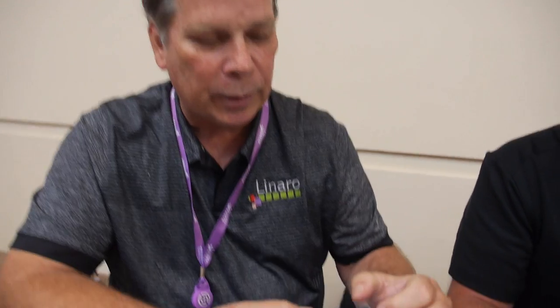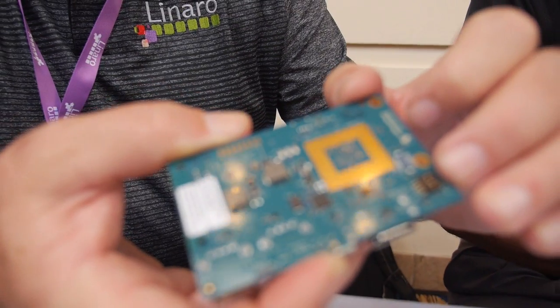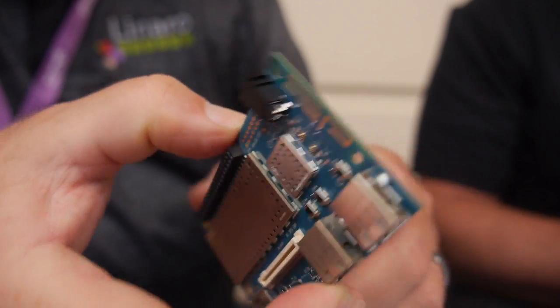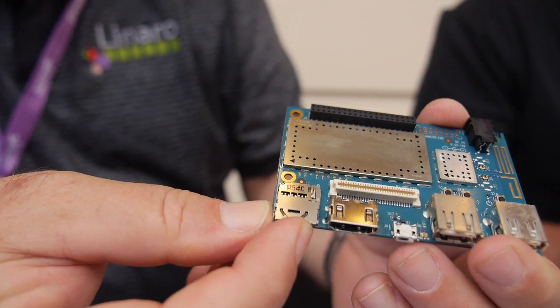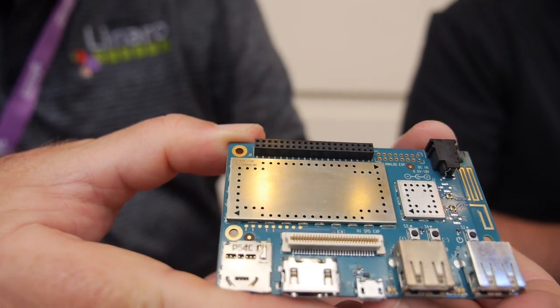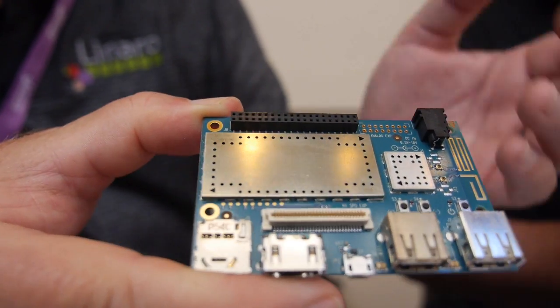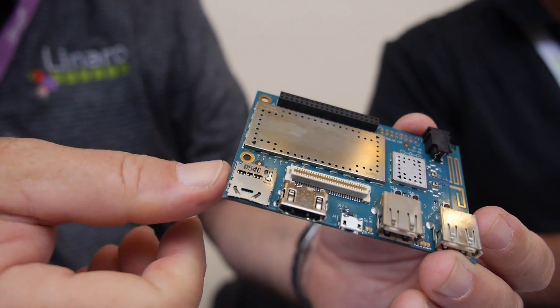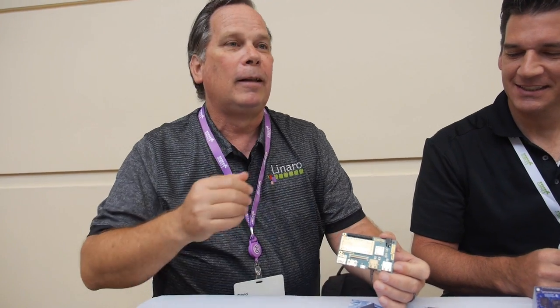This thing is also set up with some switches that enable different things, but one key thing is it says where it boots from. So this is able to boot from internal eMMC flash — the 8 gigs — or you can put a microSD in and boot from the microSD, or switch back and forth. You could have Android AOSP on internal and Ubuntu on the flash, or vice versa, working in different environments simply based on what you want to boot. I also hear Microsoft is interested in this board and they're going to bring out some kind of build of Windows 10 for it.